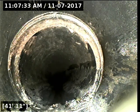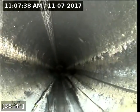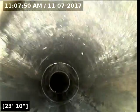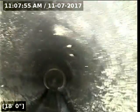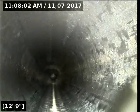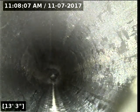But overall, the drain water is running to the main without obstruction. I don't think that growth is causing anything. But I will put it as a provisional pass and monitor that area over time for any more growth. But overall, I would say I'd pass this sewer line inspection, as there are no visible holes, cracks, offset joints, or valleys in the line retaining water.